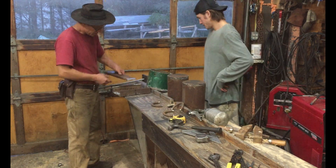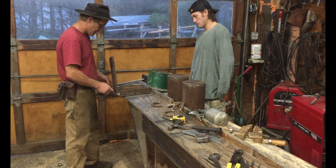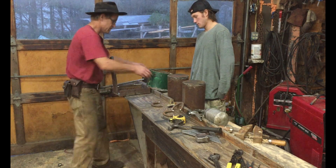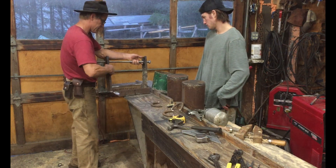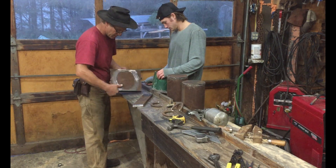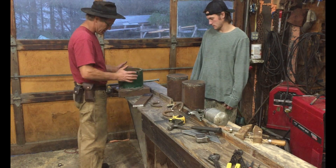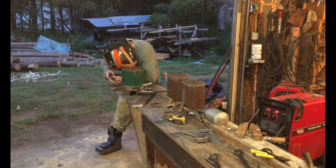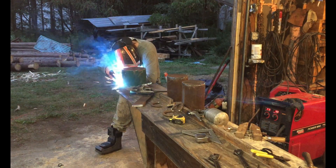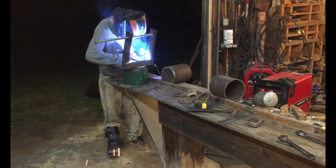This is the complicated one — this is the base that the boom sits in. You take these two; you can see where I've ground them here. You can leave a little room to run your bead along here if you want. The bolt has to be able to go through when they're assembled. This piece just basically holds the bottom of the post, so you can just tack it in four places — that'll probably be fine.